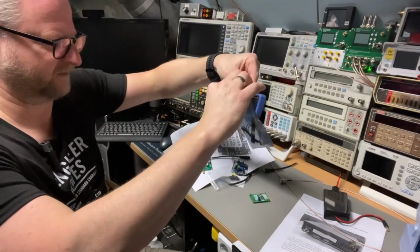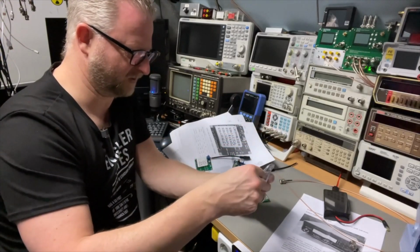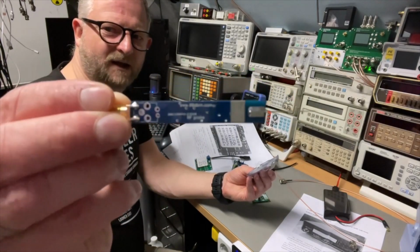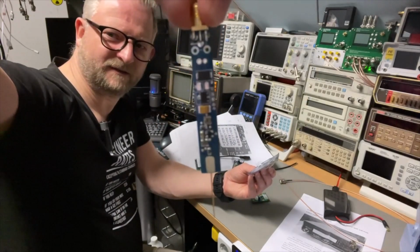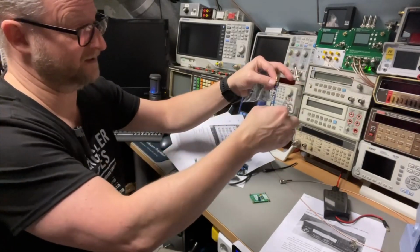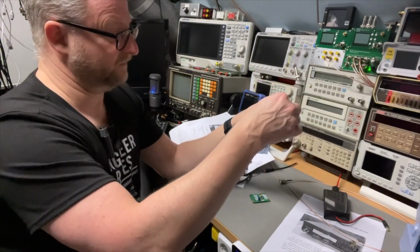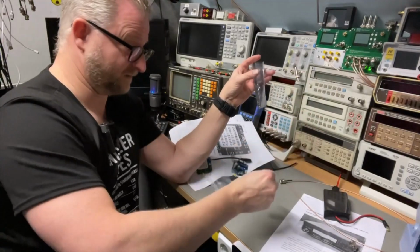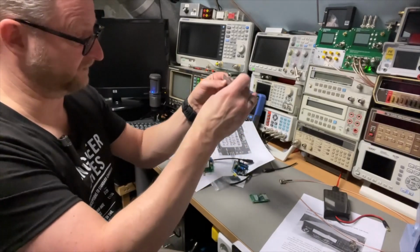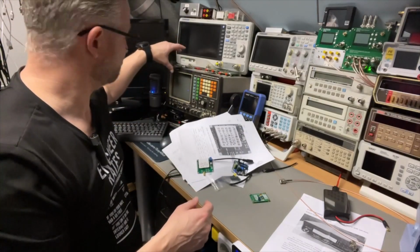I have this little RF. It's a high impedance RF probe. And I think this is from eBay, but I will probably also find it on AliExpress. And it is nicely made, so we are going to play with it. It does need a ground wire. It is not always clear, but it's said in the description. And then you should be able to probe on your frequency counter, probe in a circuit without it actually changing, because it's super high impedance, probably done with a FET. So that is nice to try once.